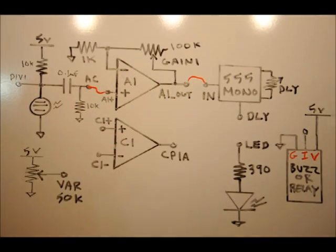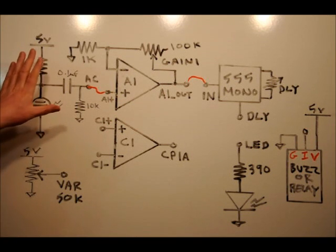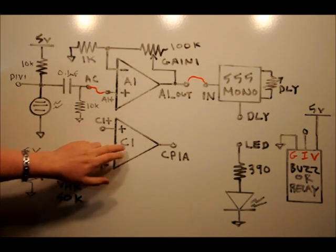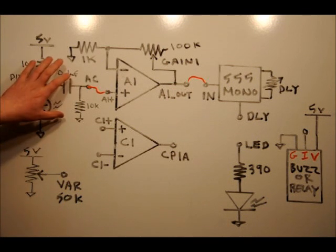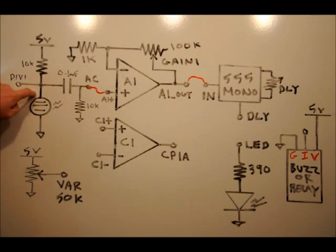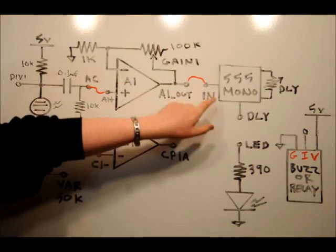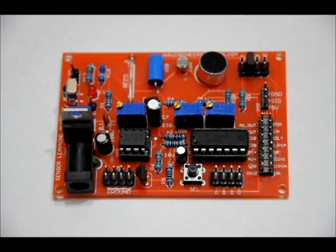I've written some code that'll be in the manual. We're also going to use not only our hand to cover the sensor but a laser tripwire. This is one of two laser tripwire light sensor circuits we're going to make. We'll talk in the next video about connecting the DIV1 output to a comparator and buzzer unit, but for this video we'll use the AC-coupled output, select the light-dependent resistor, amplify and tune the signal, use the LED as a visual indicator, and use our 555 timer in monostable mode.